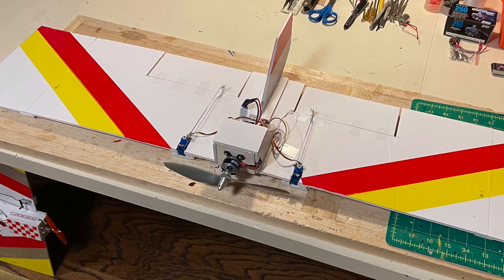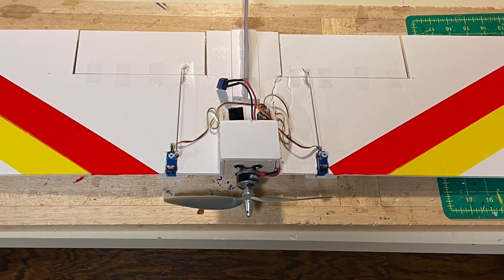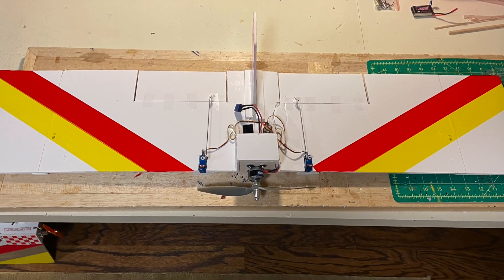Here's the completed model — motor in place, balanced. Center of gravity is very important: 25% of the way back. Ready to give it a flight. With the complete success of my square flyer — it was one of the best flying airplanes. Slow flight, handling, orientation — it was just wonderful. It weighs about nine ounces, so if you crash or ding it, it can't do much damage. And if you do, you just build another one; you can build it in less than a day.